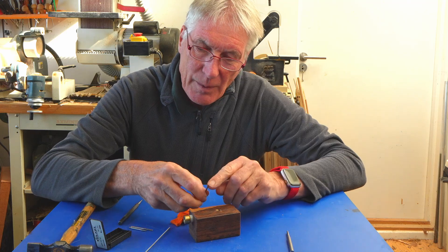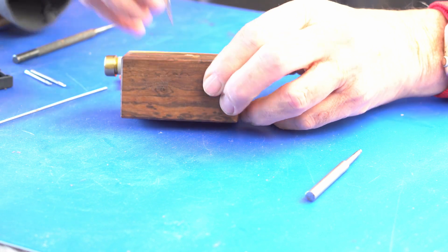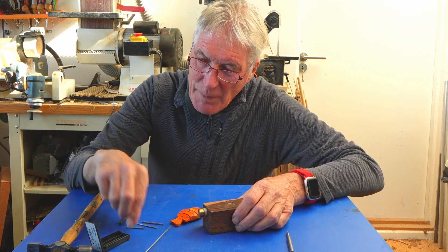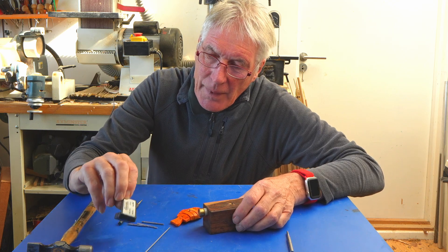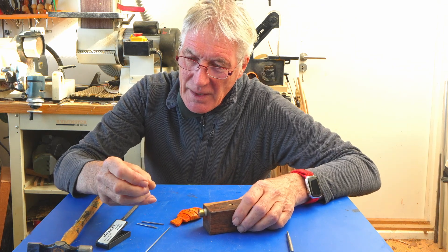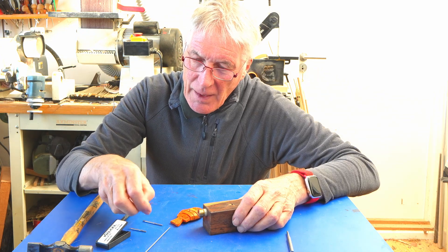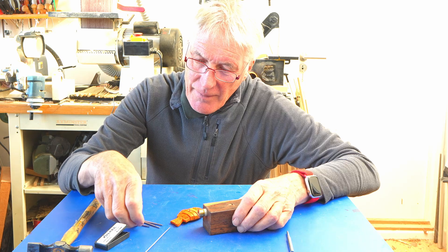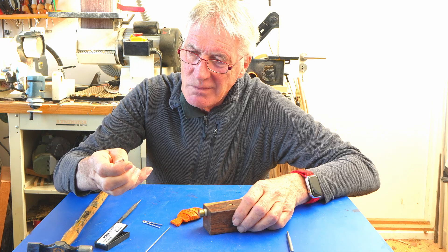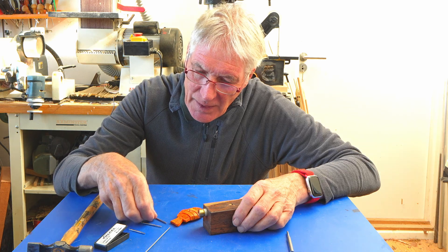So I'll have to use one that's got a bit of a taper on it. The problem there is that it needs to go further in, so I'm going to have to drill this hole a little bit further. These taps were actually quite expensive - I've bought cheap ones in the past but they're a waste of money. The problem is they're not really very well finished and they have burrs, so they don't make a nice thread. Whereas these have been very good. Very hard metal though and very thin - that's why it's snapped.